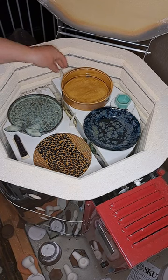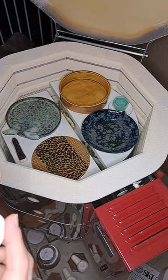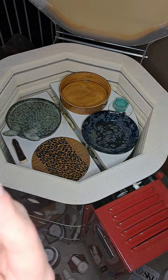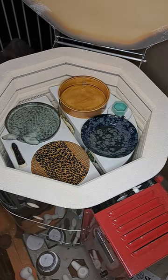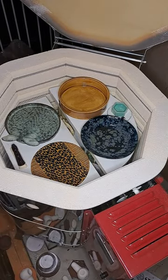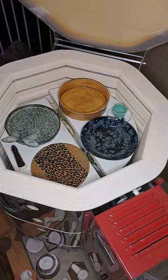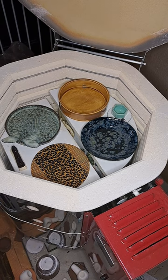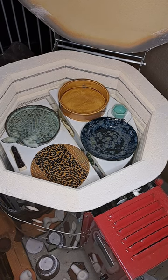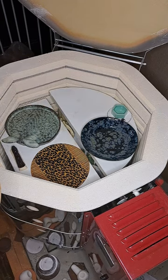Let's start off with the cones. I've got two different sets of cones — one on the top, one on the bottom — and I went for a cone five with a 20-minute hold. So here's five, here's six, and here's seven. I've been trying to adjust the cone five so that I maybe get a cone six, because every time I do a cone six I get a cone seven. I'm trying to get the perfect six, but obviously that isn't the way — we'll try something else next time.